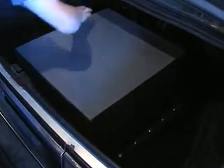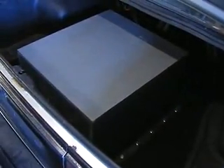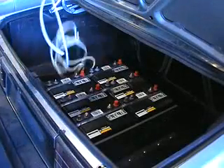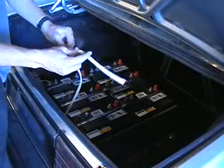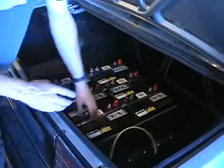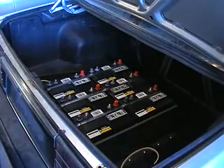Hey, that is perfect — brilliant! The battery box goes in. Now I am going to surround the top of the bottom half of the box with this adhesive foam surround, which will sit between the top and bottom sections and stop gas from escaping while the batteries are charging.